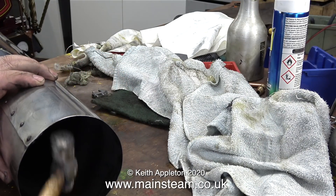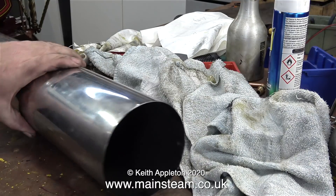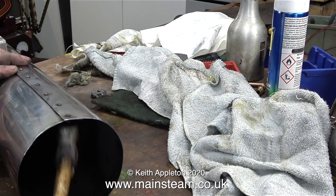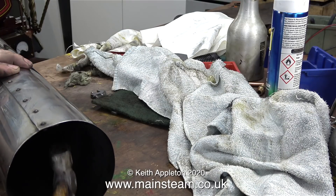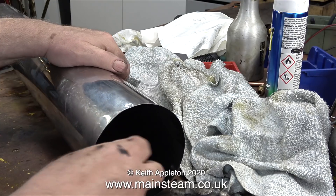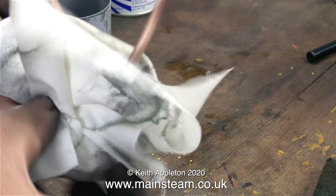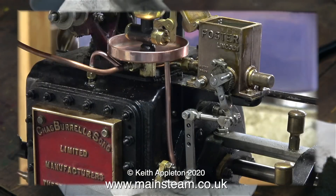This clip is speeded up and by the careful use of a small hammer I'm knocking out as many dints as possible from the chimney extension. Some of the dints took quite a while to knock out, but patience is a virtue and after a while I got there. I was only concerned with the dints on the edges — I couldn't really get to the ones down inside the tube. In no time at all, my Kilrock K acid in the acid bath — Kilrock K by the way is kettle descaler — had done its stuff on the copper part. After using my polishing spindle followed by some Brasso, wadding, and a cloth, it now looks like this.